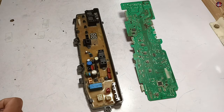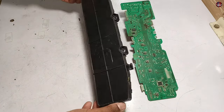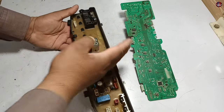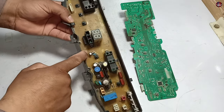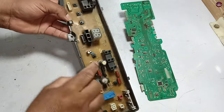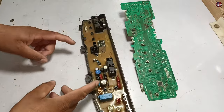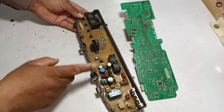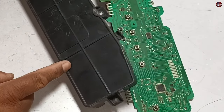The circuit board of the top load washing machine is packed something like this. The circuit boards of the front load washing machine are also now manufactured similarly to top loaders. Most inverter washing machine circuit boards have a coat of silicone put on them, and the back side of the circuit board is also packed. I was stressing about tracing the correct wire because once you have identified the correct wire of the drain pump and which connector it plugs into, it will be easier for you to know where to cut the circuit board from the back to repair it.